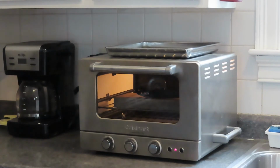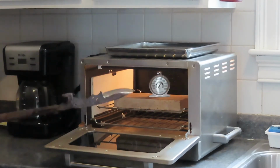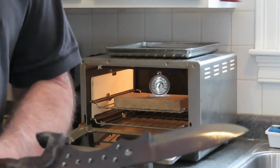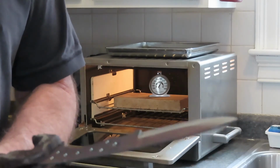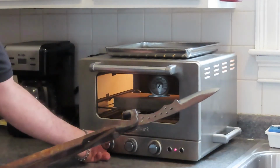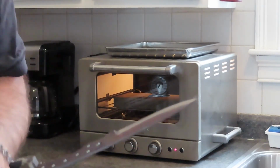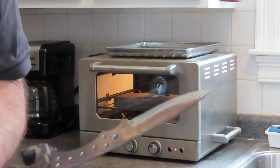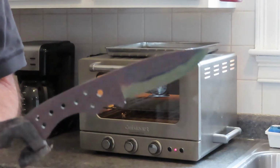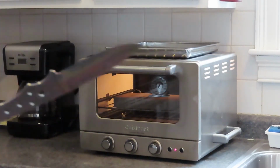Okay guys, this is the second thermal cycle, and let's see if we can grab this without losing it. Really just barely has a straw color to it this time, but the first time it came out it was a darker version of straw, so I'm pretty happy. I'm calling it good. So turn this off, and next trick is I'm going to blue this. So probably clean it up once on the grinder, and then we're going to blue it. And then tomorrow I think is going to be the day to put the scales on it. So we're getting there. It's going to look like a nice knife, I think. So alright guys, next step is bluing.